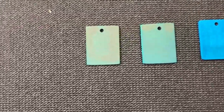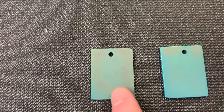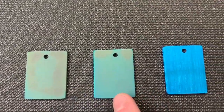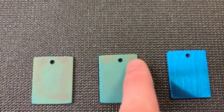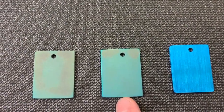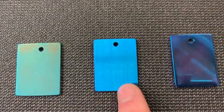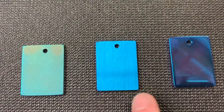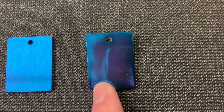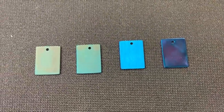This is 93 volts on my anno tank. You can see on our blasted piece we're starting to get some strange discoloration — it looks more green, blobby green. On our tumbled piece we're also getting some of that strange discoloration, and the piece is getting very hot, so there are a couple things that could be causing that. This is like a green aqua type color. The satin is blue, and the polished one is also basically blue.